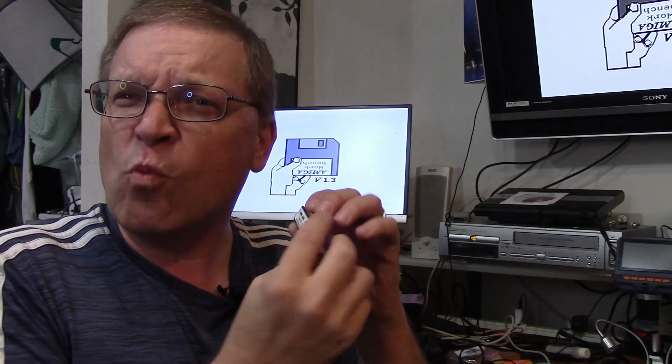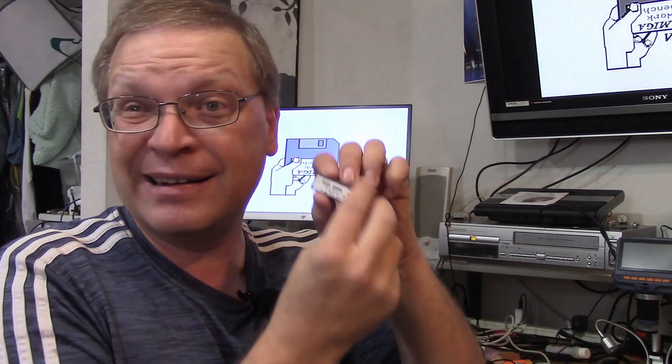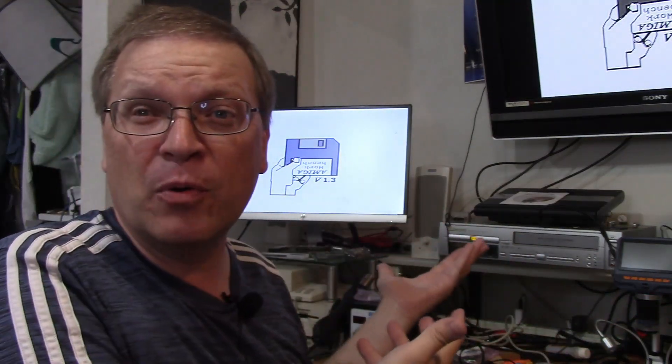I did try it with one of my DiagROMs — this is Chucky Hertel's DiagROM, I got it from our good friends at Retro Rewind. But I'm wondering if this isn't going to work because this is made with a newer EEPROM — the kind that my Amiga 500 Rev 5 just won't work with without modification, because I get nothing, just a funky screen. But I put my 1.3 ROM back in — fine, works, tries to boot up okay.